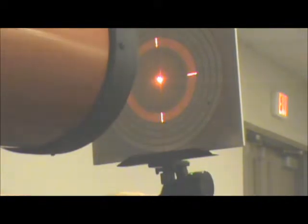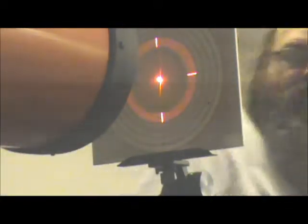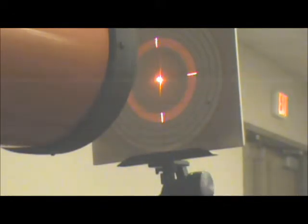Looks like it's dead center on the front of the scope too. It is too? Yep. Okay, we'll go from here. I'm looking around, so you don't have any adjustments here though. There's no way we can adjust your primary mirror. The best we can do is adjust the corrector plate and the secondary mirror. That's the best we can do.